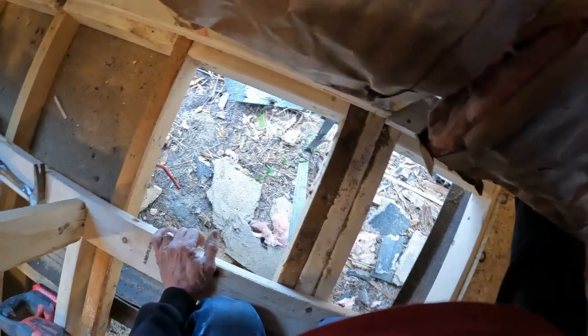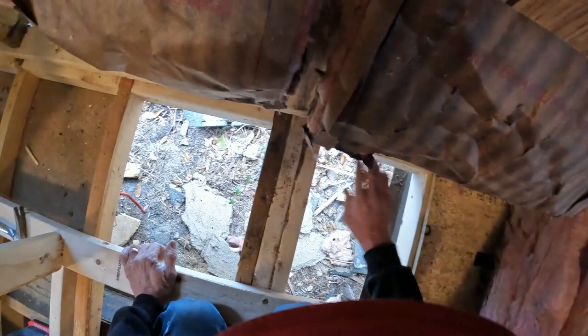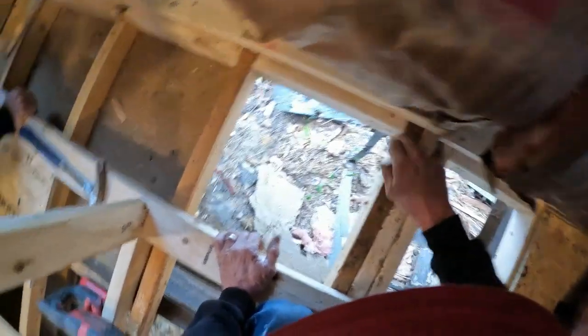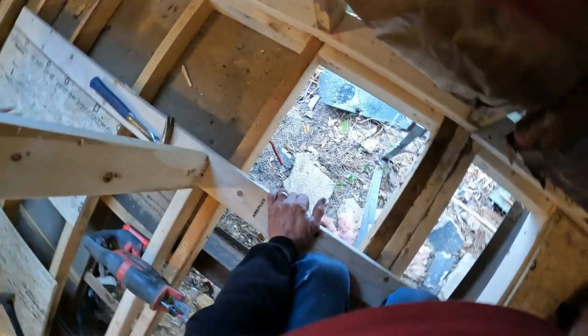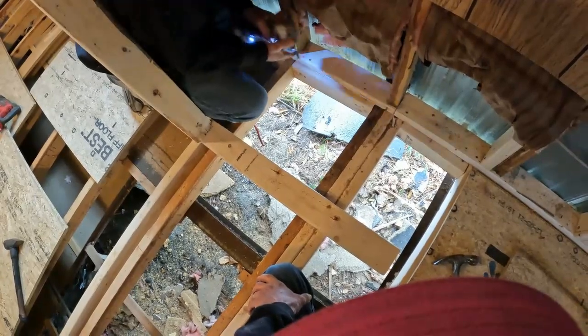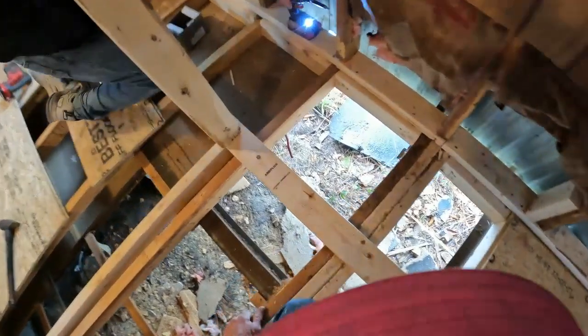This wall here. See, the outside band has popped out a little bit right there, because right now, Paul, I'm flush out there. Tying in the bottom plate to the outside band, and that's what you want to do. Tying in the bottom plate everywhere where you can. This will tie it all together.